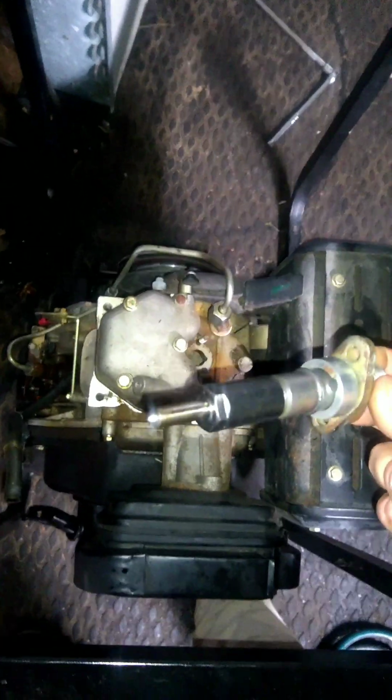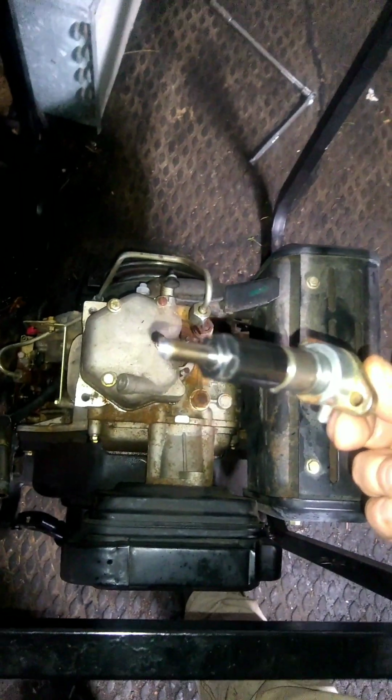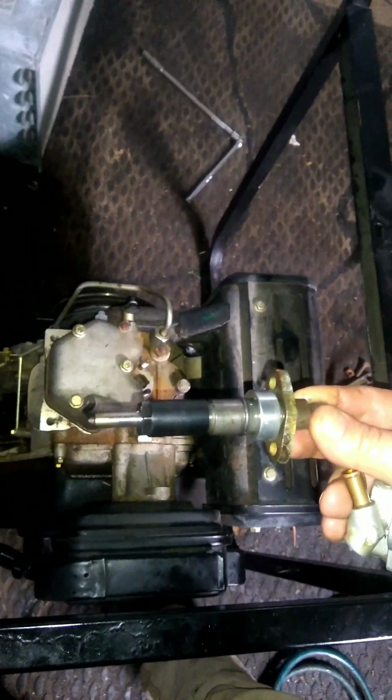The thing was running fine. I figured while I had the tank off the top, I'd go ahead and pull the injector and clean the tip of the nozzle. Definitely was not that clean when I pulled it out. I'll be showing y'all another video. The next video is actually going to be me taking this injector apart. It's a Bosch style injector. Yanmar actually uses Bosch injectors. This is China Bosch, so we call it borscht. Some of y'all know where I got that from. Cheap like borscht.